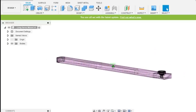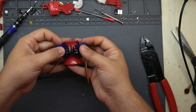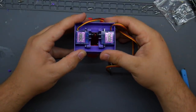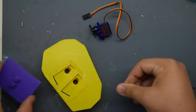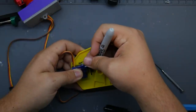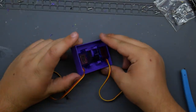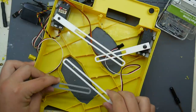Since the servos are in different positions in the arena, two sizes of servo mounts were needed: the larger mount for the X axis, and the smaller for the Y axis. For the upper torso, I needed to fit two micro servos in each robot, so I designed a new torso piece to hold the servos with a hole in the center for the metal pieces connected to the arms. The plan was to use a total of ten servos — five per robot: two for the arms, one for side-to-side rotation mimicking a slip maneuver, and two in the base for X and Y movement.